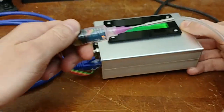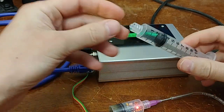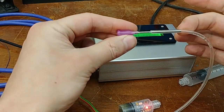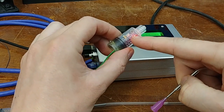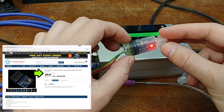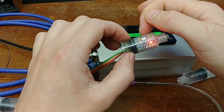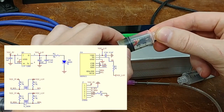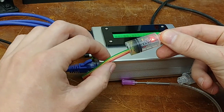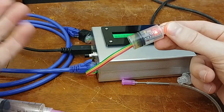The actual pressure sensor is located inside here. The enclosure is a 10 milliliter syringe — you can get these on Amazon very inexpensively. They have convenient twist connectors so you can attach anything to the end. You can also get blunt needles on Amazon. Here is a breakout board for the MS5611, which I got from icstation.com. This board is pretty cool — it's a little bit less than $10, and it already has the pressure sensor, the small silver device on top, broken out to accommodate a 5-volt power supply.